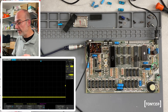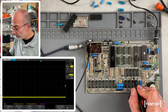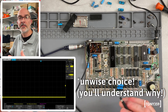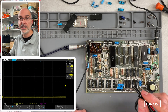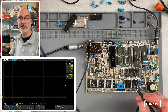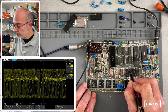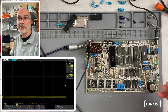We still have a faulty memory module. Before we blindly replace it, let's do a quick test with the oscilloscope. First, let's make sure we've got 5 volts on the IC — yes, we've got 5 volts, totally fine. I can compare IC20 with IC21 and look for any obvious difference on an address line or data line. We checked the address and data lines on the CPU and couldn't see anything wrong, so I'm probably not expecting to see anything here. I don't see anything obviously wrong, so let's just replace the IC.